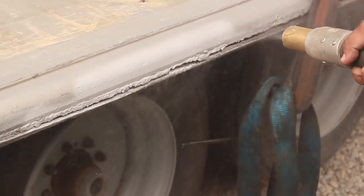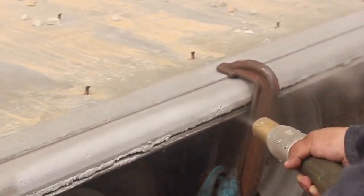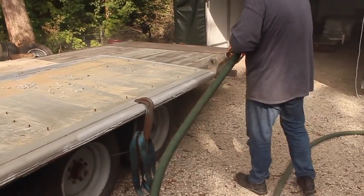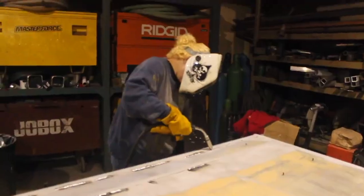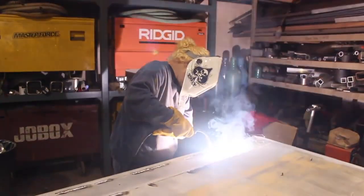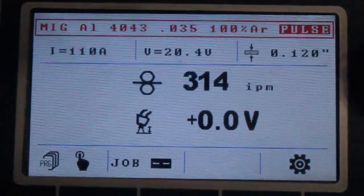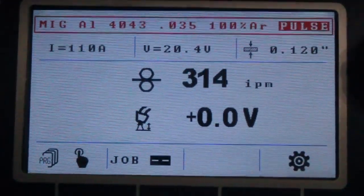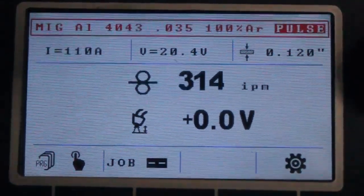And once we had sandblasted away huge amounts of caked on aluminum oxide and various forms of foreign debris from where we'll be working, we set about getting this all welded up with the extremely versatile ProPulse 200 from our channel sponsor HTP. Today we're welding this dump truck tailgate, all aluminum, with some 035 aluminum wire. We picked the 4043 wire. We're welding this in pulse.